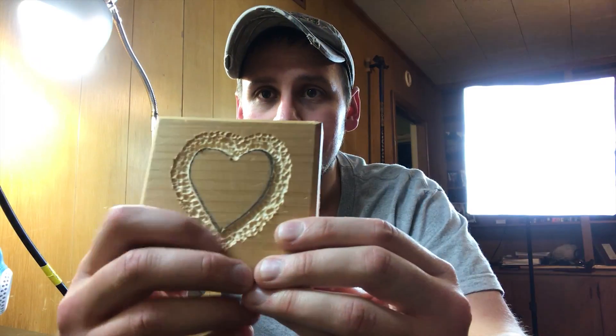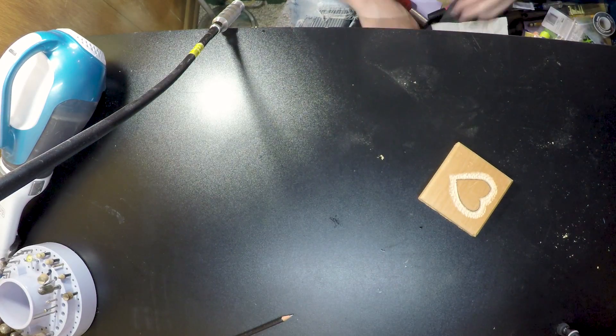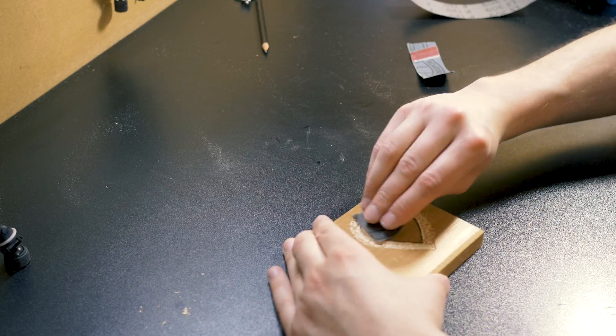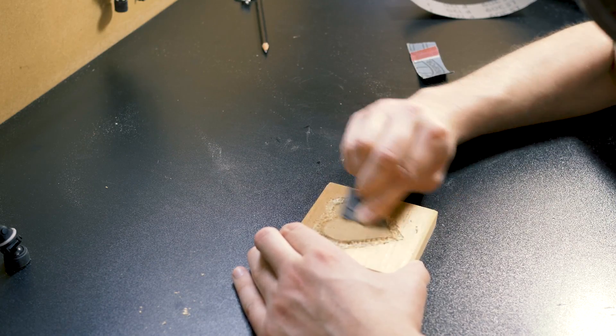Okay I just got through stippling and I got this pretty much where I want it. Now it's a little rough, but there's something else we can do to make this look a little bit better — a finishing technique that involves sandpaper. A lot of people won't teach you this. We're going to take this — I think it's 120 grit — and finish up maybe with a 200 or something. We're going to do this to take the pencil markings out and to curve the outer edges of where we carved. That's where a lot of people go wrong — they never curve off their edges.